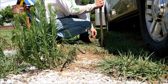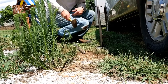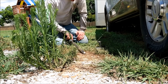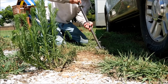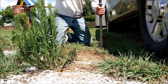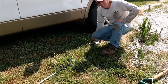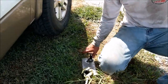We'll stake our first stake. This is just regular soil here. It's 24 inches long, so it takes a few hammers because I want to be able to get out of any situation with a fully loaded trailer, so I'm going to need a lot of pull on this stake. Now I'll line this one up. Hooked up here to our first stake, and then the gang plate will bring in the second stake as soon as it starts to move.